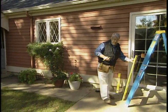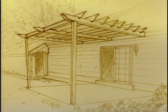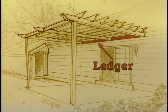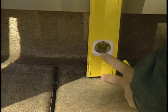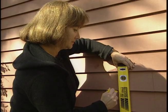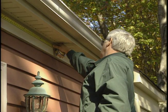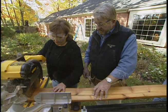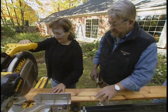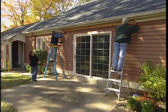Let me give you a picture of what we're going to be doing today. You can imagine this pergola as kind of a roof that's going to extend out over this patio. The first piece we'll install is called a ledger. Since we want the pergola the same size as the existing patio, we start at the edges of the patio and draw vertical lines up the side of the house. By measuring between these lines, we can calculate the length of the ledger. Okay, 139.